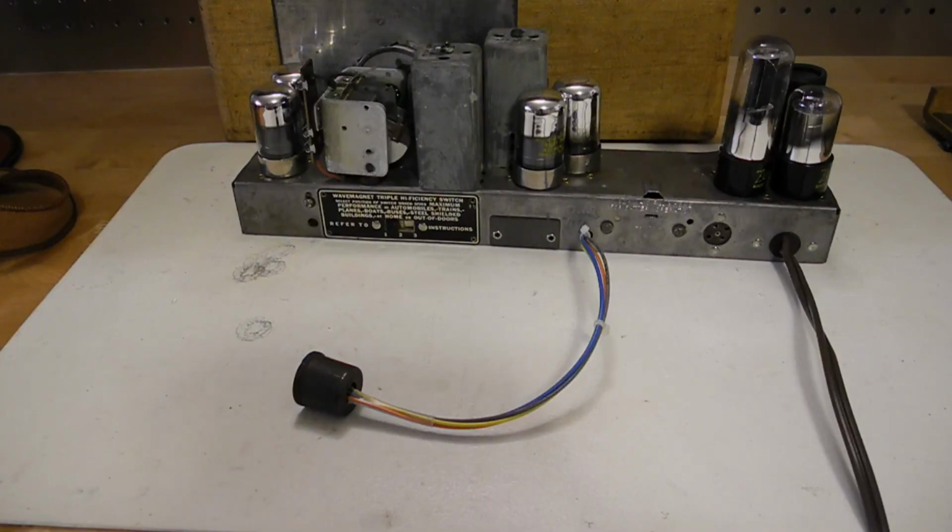There are some options for the battery which is no longer obtainable. You can use 6 D cells for the 9-volt supply and 10 9-volt batteries to generate the 90-volt supply. If desired, you could put this in a cardboard or wooden box of suitable size. This will work but won't last too long with 9-volt batteries.